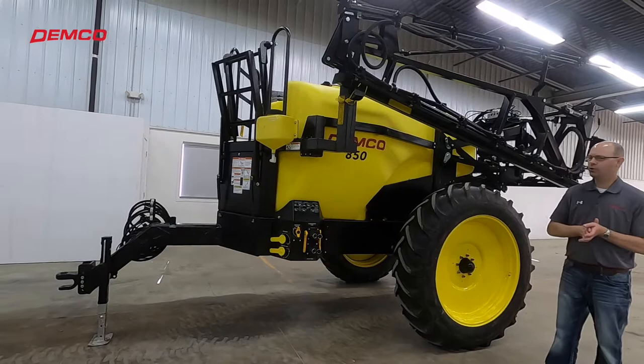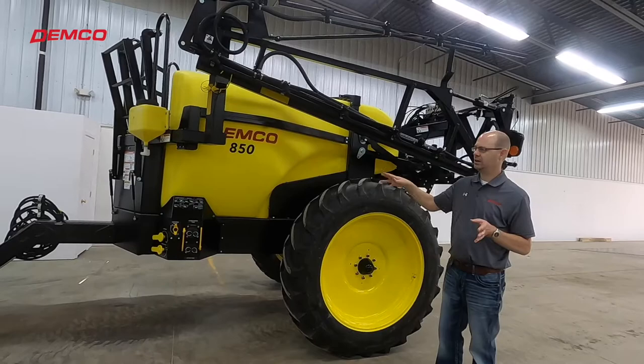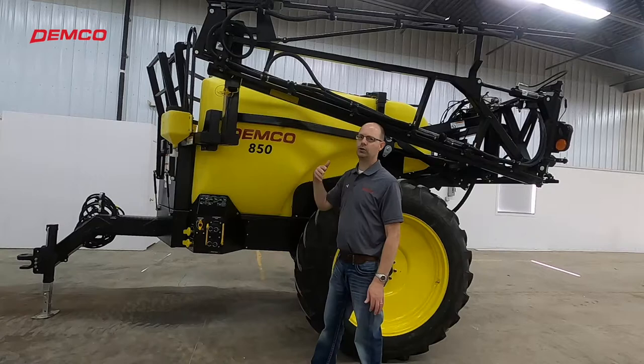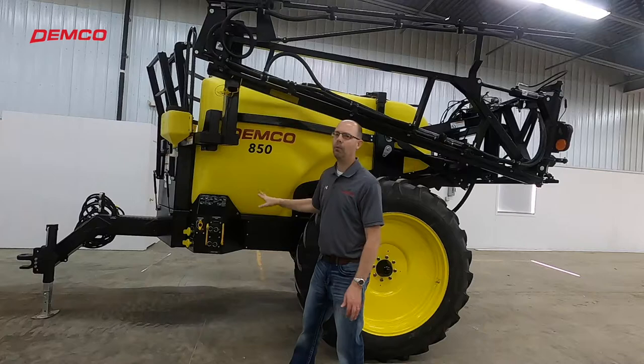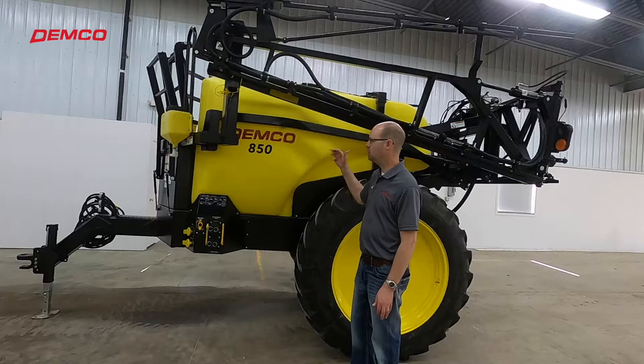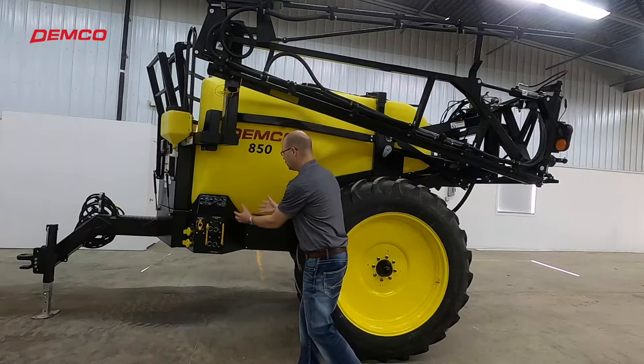Another really big feature is the tank — it's a unique design and Demco was one of the first to come out with it. The tank allows for a short trailer while still delivering a lot of value in getting the spraying done right. It slopes from the back down into a deep sump, and that deep sump has agitation in it so everything gets very well mixed before it goes out to your sprayer boom. You're going to mix the chemical very well.